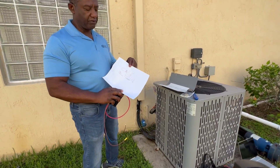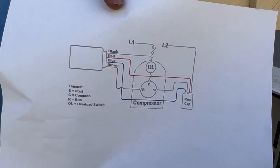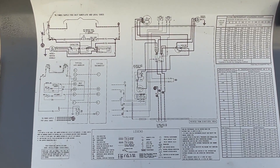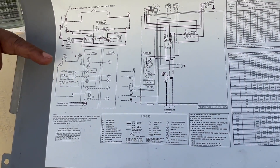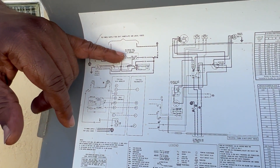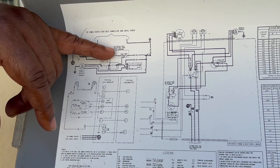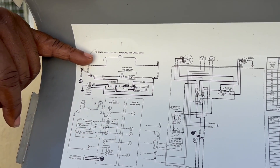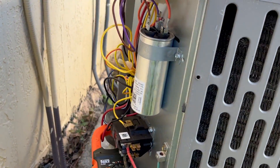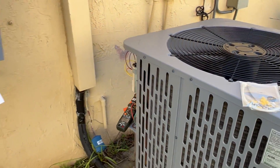This is a typical wiring diagram for a soft start. As you will see, it's four wires — not very complicated. But when you look at the diagram on your actual unit, whether it's an RV or a residential unit, you're going to see a lot of wires. The key things to notice are the wires for the compressor. If the unit comes with a start capacitor, a start relay, or a PTCR, those devices need to be removed. In this particular unit, it doesn't have those — all you're going to see is just the run capacitor and the contactor.